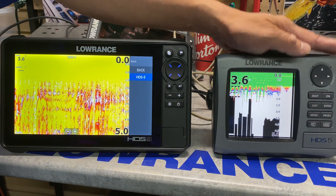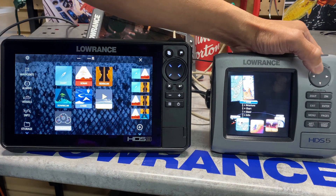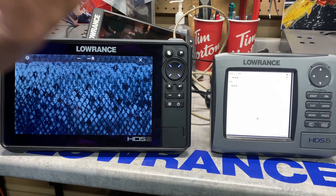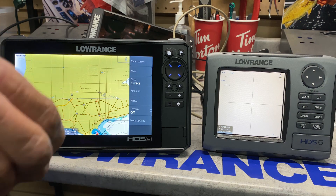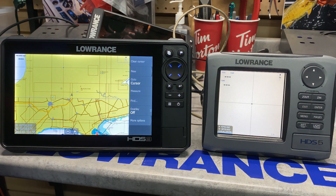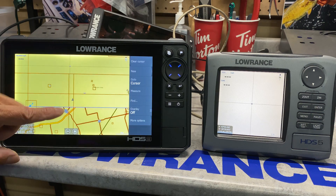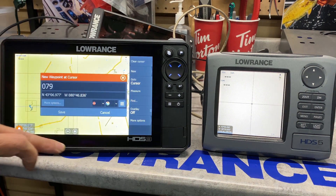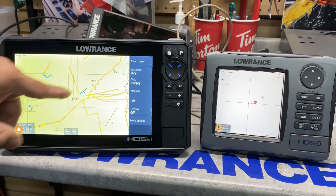This is only a Generation 1, so I can't Navionics share, but I can still waypoint share. I go to the page button, go to the map screen, press enter. Any system — you still want to do a test to confirm it's still communicating. I zoom out. We're doing a test to make sure the units are communicating properly — this is a very important test on all HDSs, regardless of legacy. Anytime you network two Lowrance units together, we zoom in a little bit, touch the right side of the screen, hit the flag button, put a stop sign, and save it. Our stop sign showed up on the other unit, which means they're talking together — this is a good thing.